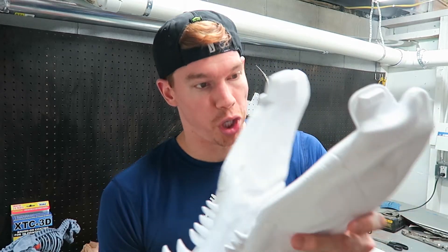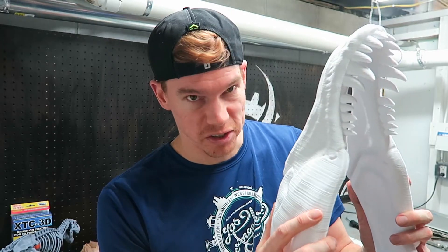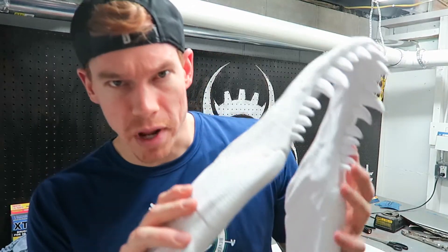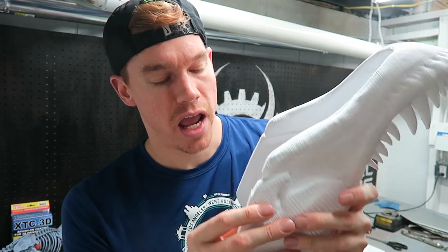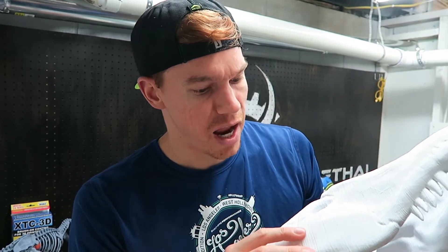Until I print the skull — that will then be the longest print. Looking at this jaw print, overall the quality is pretty poor. I'm not sure if it's necessarily the printer's fault or the fact that it's just such a large print with very little contact area with the bed, causing the print to shift slightly as the print head runs across, resulting in really uneven layer lines that I'll have to sand off. There's also one major defect — a big gap right here where a support buckled a little bit, causing a shift. I'll add some epoxy and Bondo-type substance to fill that in, and hopefully you won't be able to tell after sanding.